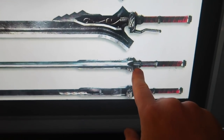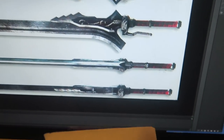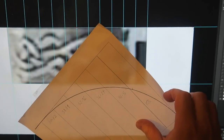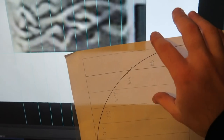And I have these groovy side views and top-down views, but it's a side view of a curved surface, the round guard piece. So I could copy paste those, but then I had to do tricky math to translate the curved surface to the flat surface. See, like, so which one was it? This one. So this side here is broken up into 1, 2, 3, 4, 5, 6 segments, using the numbers I got from printing out a quarter circle and then noting the difference between the different parts. So that's 30 mil, and then when you measure this down here, it's 105. I was so proud of myself using just the vernier, walking it along at 10 millimeter segments. We got a total figure when you add up all these numbers together of, where is it gone?